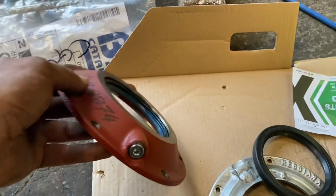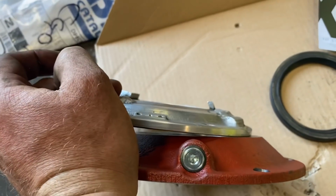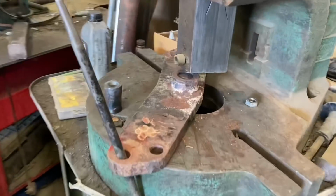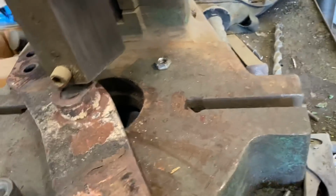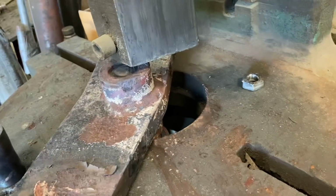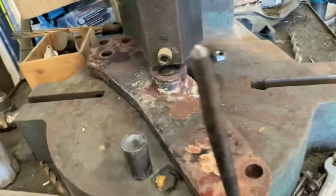I've got the new part here. It's a lot thicker than the other one, because the other one obviously had worn away. The difference now. This one's made of cast steel rather than aluminium, so it should last longer hopefully. So after heating that, cooling it, trying the induction torch on it, then the gas torch, injecting water down the middle, everything, couldn't get it to move. Rung up Bateman because then I realised that one of these holes was worn. So I thought, well, I'll just get the new piece, which fortunately will arrive tomorrow.